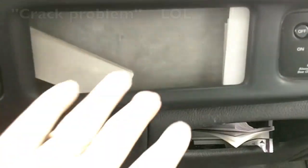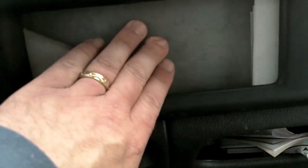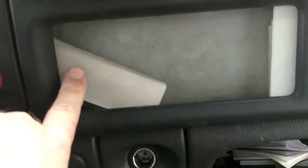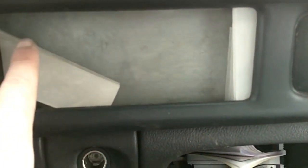To solve that gap problem, I just cut some shims out — these are just leftover scraps of the same material I'm using, which happens to be a quarter inch thick. So if you use all quarter-inch material, you know that one sheet plus three shim packs will get you nice and flush. I'll get a nice edge around there and it works on both sides, so everything is good.